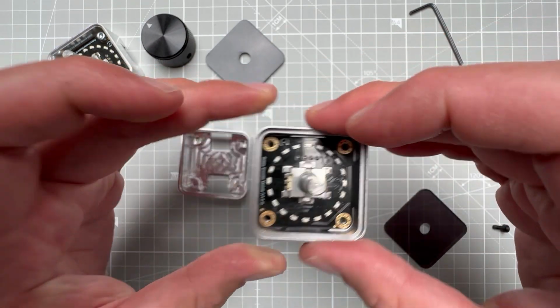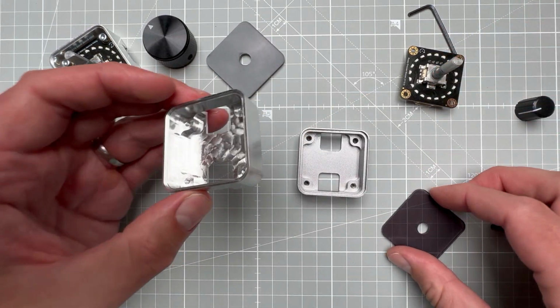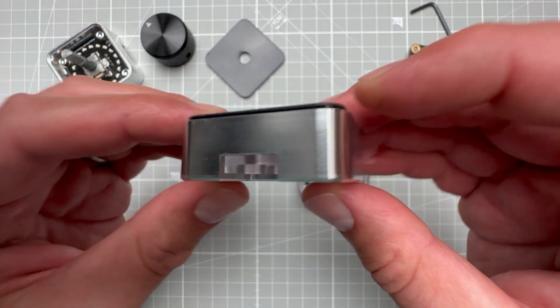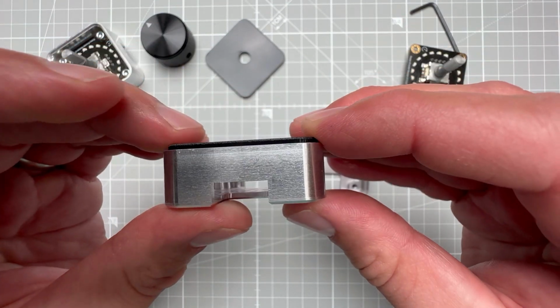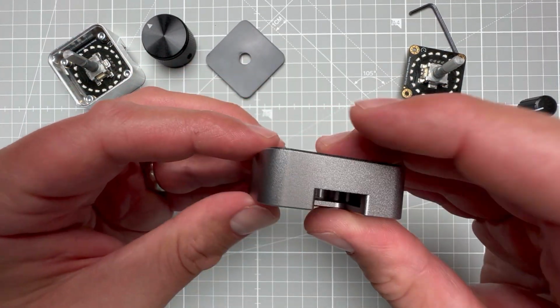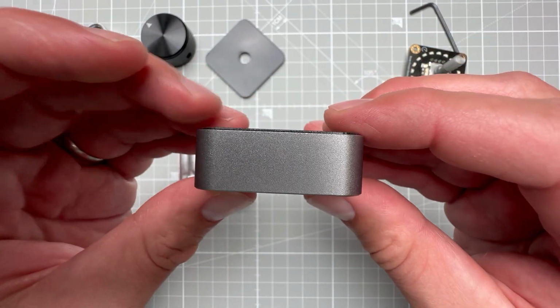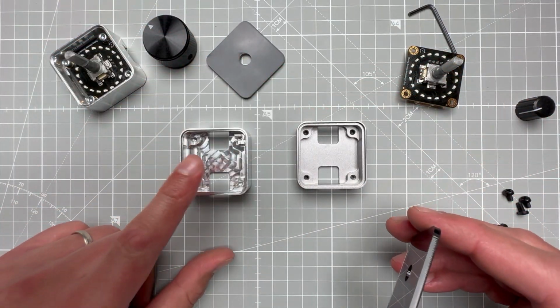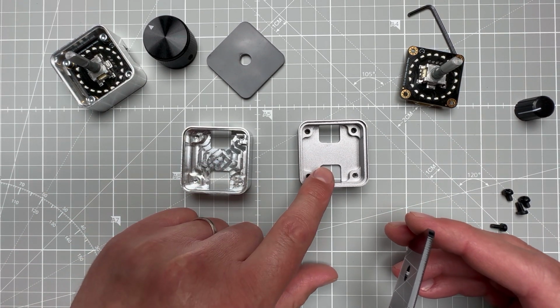The last difference is about the rim size for the acrylic glass. In the first version the extrusion inside is only 1mm, so when you put the acrylic glass over the enclosure it just sticks out quite a lot. It's 2mm for the second version, so the acrylic glass is more inside of the case while still not touching the module. If you want to know about the price, the left one costs about 3 beers, the one from the PCBWay is around $37.